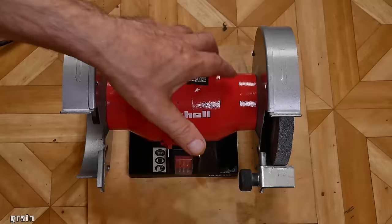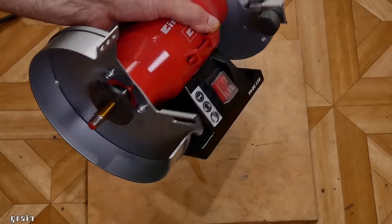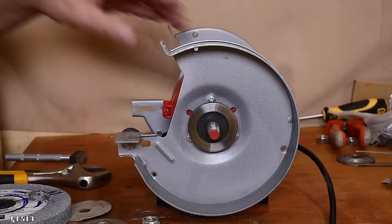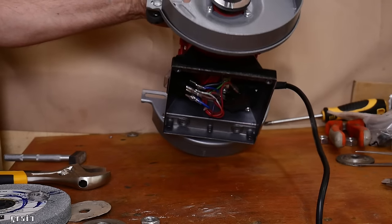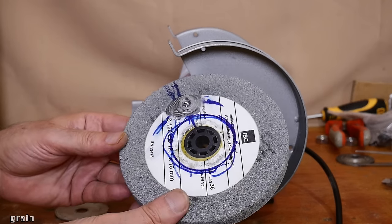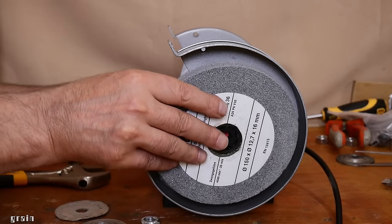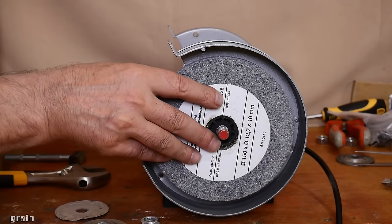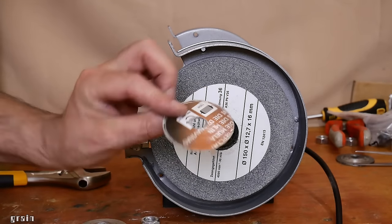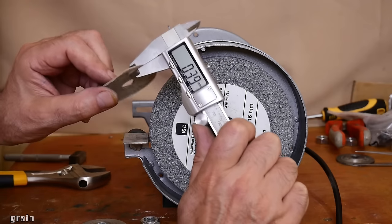Now you can put a balanced disc on the grinder and correct the geometry with a diamond more accurately. And I forgot to say that each disc is checked on the grinder separately. I do the test of the first disc. The grinder stands on the table without fastening and without rubber feet. You need thin cardboard under the washer, because the disc is fragile.